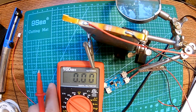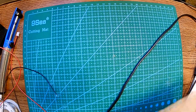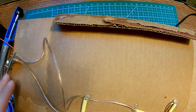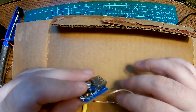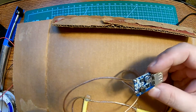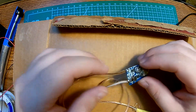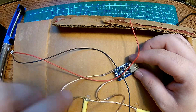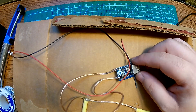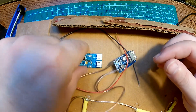We still have two more things to do. On this solar array I've got here, I'm going to flip it around. I already have two of them wired in parallel. The top one is the negative wire, and then I have the positive one. The boost circuit, as I said, didn't work properly with this setup, so I'm going to unsolder it, put in one of these connectors, and move everything to plug into the little circuit board. Let's get on with it.